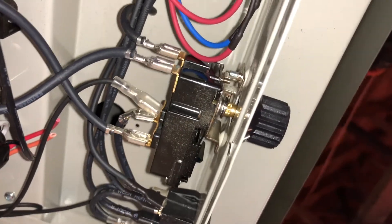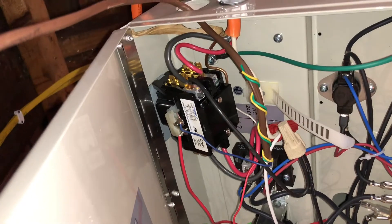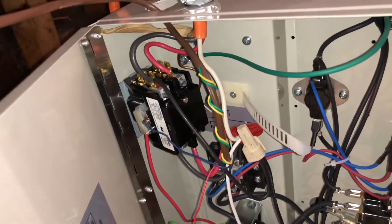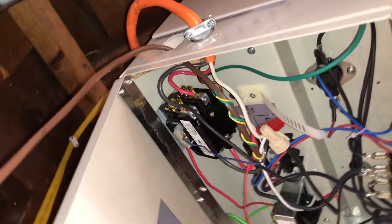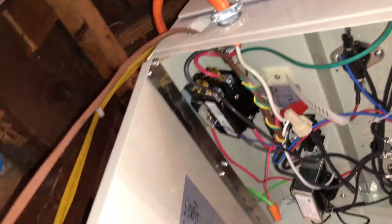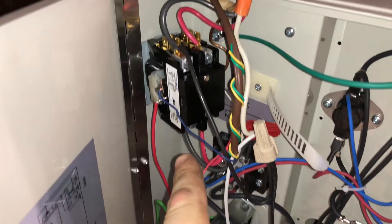I figured there's really no way to bypass that thermostat because it uses both phases. So what I did was find a contactor — which is what that's called — which is just a little electromagnetic switch for 240 volts. I just got this working so I will clean this up, I promise. What that thing does is it takes a 24 volt AC signal; this module right here charges an electric coil which pulls a giant copper plate closed and contacts the 240 volts straight through it. I've got the power coming in from my breaker into the contactor — two phases in and two phases out going into the factory lug on the heater.